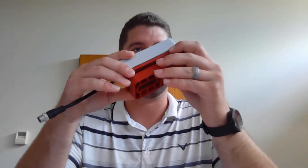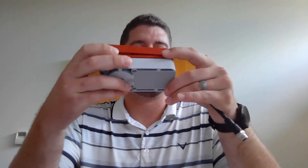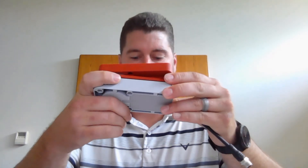It's a magnetic safety switch. Internally it is RFID coded, so it uses RFID technology to determine whether or not the switch has been made, but it does use magnets for holding — there's just a simple magnet on here. When that fifth pin is activated and given power, it has a 500 Newton holding force.